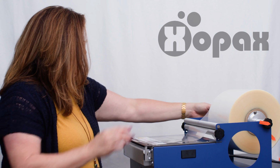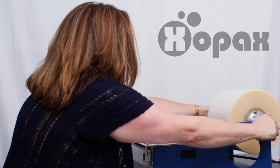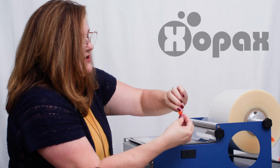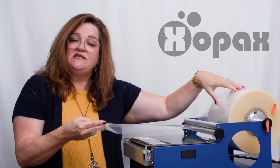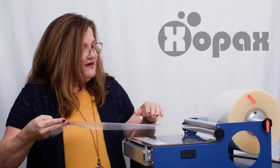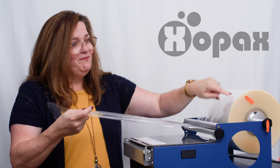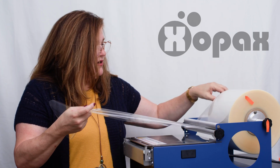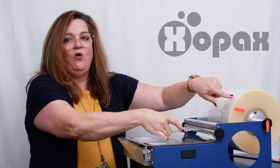So simply, all we're going to do is tighten the bars, tighten these end caps on these bars with our hands. And I'm going to put this back on so that you can see that now that I've taken a moment and tightened those, it no longer spins. The bar should not be spinning. Instead, what should be happening is the roll of film should be spinning, and you can see it moving on these end caps. Now, once I've secured this and I've secured this, if it's really hard for me to get this to move, it could be that my end caps are too tight. If when you put your roll on the bar of film or the media bar, you tighten those too tightly or they're pressed in too close to the bar, you're not going to be able to get that to slide or to roll on there.